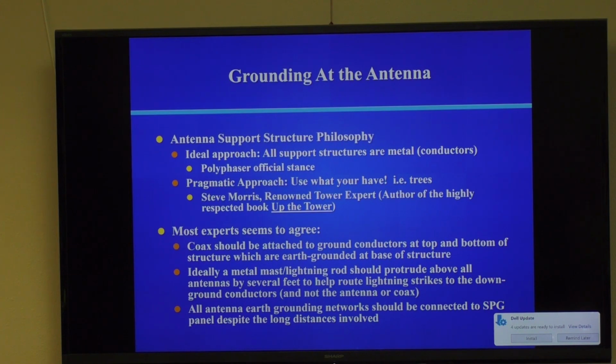Yeah, what he's talking about, Erico, the company Erico makes several useful grounding things. They make these little kits. I don't know what chemical is in there, but you light it, and it fizzes and sparks and creates a bright white flash, and it welds itself all in one shot. You don't even have to know welding or brazing or anything like that. The problem is those Erico, and they have a name for them. I forget what they're called. Thermite. Yeah. Those thermite things are only available in certain very limited connections, like connecting one ground wire to another. I could not find anything made by Erico to connect straps to ground rods.